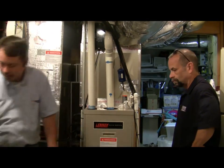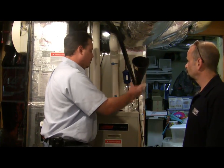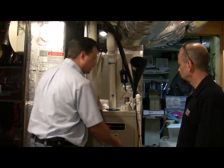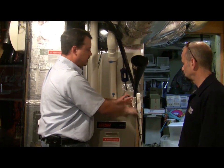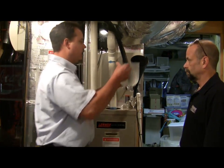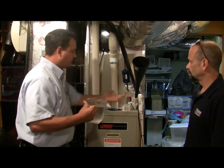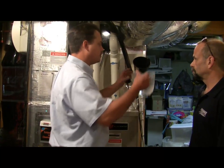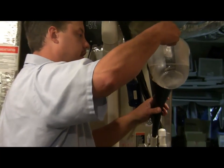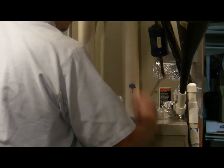Let's show you real quick — we build it this way and it kind of makes sense. It's hard to pour water in here because you've got a lot of electrical controls and we don't want to be pouring water down inside the controls. That's the reason for the extension, the pump, and a funnel. What we're doing now is a steady drip — very slow to fill up, very slow to come out. Basically we're just putting a little bit of force behind the water as it goes in. We just manually poured water in and back flushed the pan.